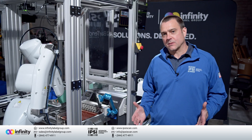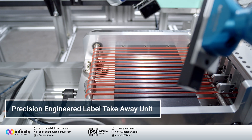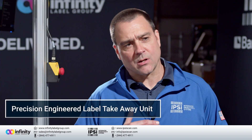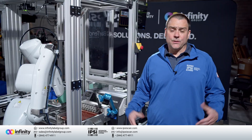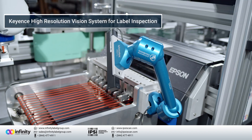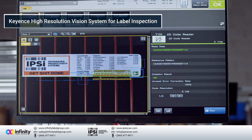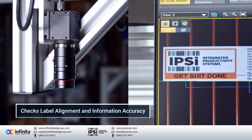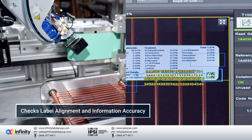Another key feature of this system is the label delivery unit. This is a critical piece that has to deliver the label consistently to the same place so that the robot can pick it up, and it ensures the label printer and label takeaway unit are completely aligned in their operation. No system is complete without a vision system — our vision inspection system inspects the label prior to application, ensuring it is placed properly on the label takeaway unit, and also measures lot code information and readability of the two-dimensional barcode.